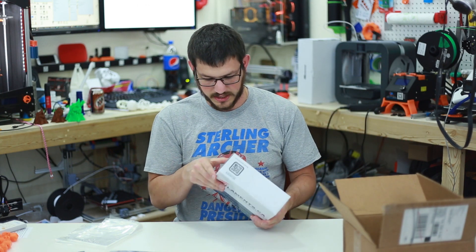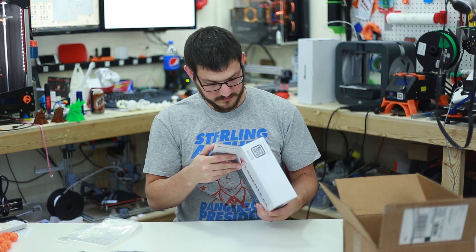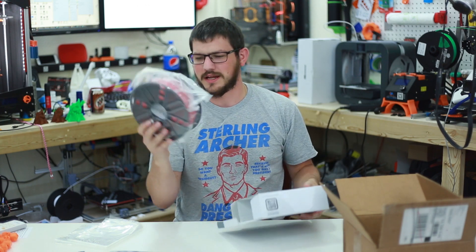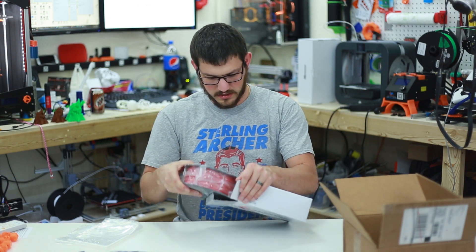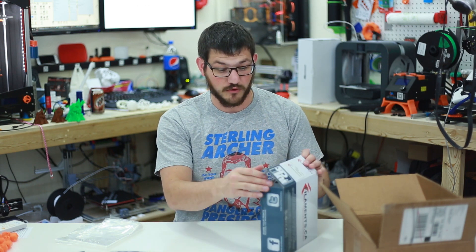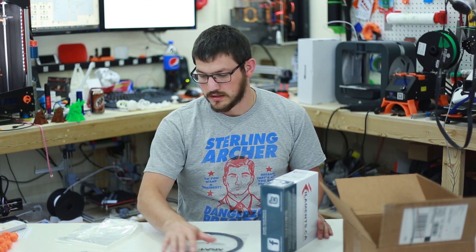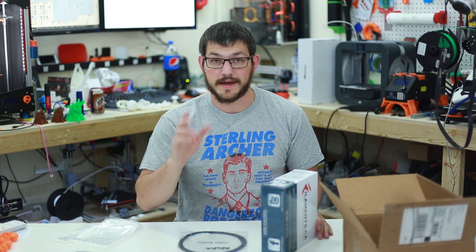And lastly we have a full roll — I thought it was solid blue PLA, but it's actually solid red! 1.75mm, nozzle 190–230°C, base plate 60–80°C. So I'll print a few models with the red in a separate review video, and for this video I'll print my MakerCoin in all of the sample filaments and see how they all turn out. Let's hit some time lapses and come back.